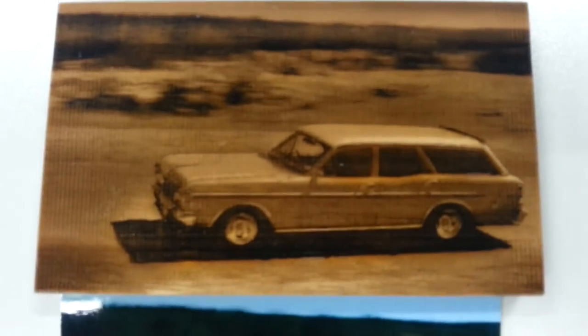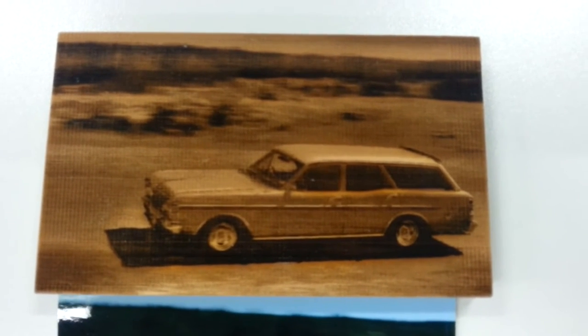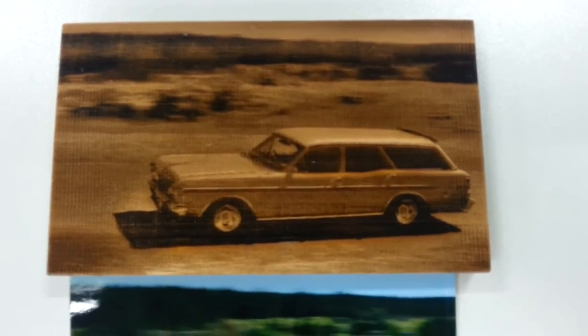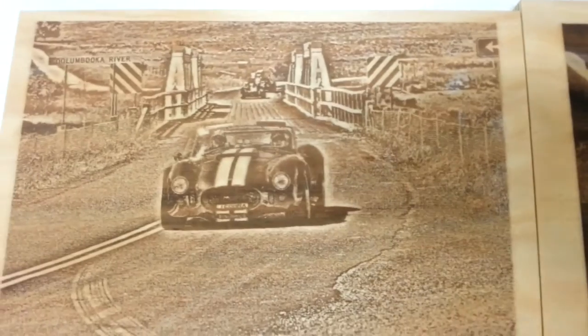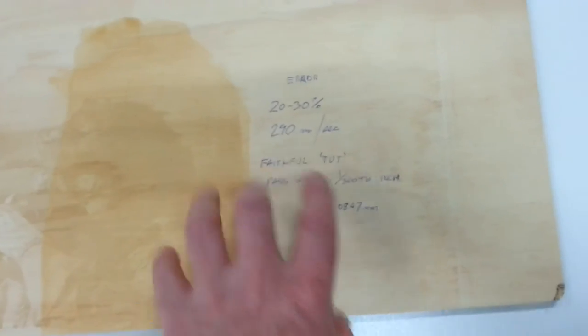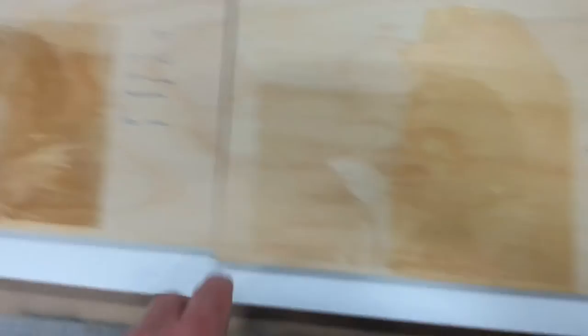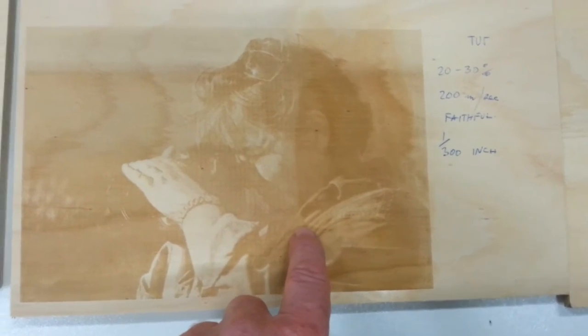The passes have to match the pixel height of your photo print. Working backwards, this example uses 0.15mm between passes, this one is 0.2mm, and this one is 0.1mm between passes. Each one of these examples uses the ordered dithering like I showed in my videos — these are all faithful renditions. The amount of energy being thrown at this plywood is nowhere near enough, so to get more intensity I dropped the speed to 200 millimetres a second, otherwise identical to the previous one. I also added some oil wax to see what darkness I could get out of the laser engraving — still not dark enough.